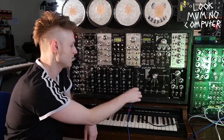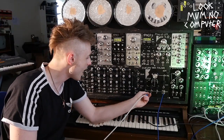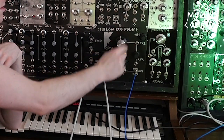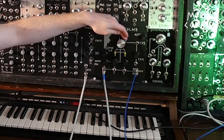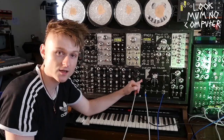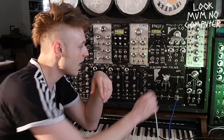Right next to it I've got a filter — it's actually an MS-20 style filter. It's got clipping diodes, so when you twist it you can see the diodes are clipping the audio, and the resonance does that. There's a link for the schematic of this filter in the description — you should check it out because it's a really easy and nice filter.